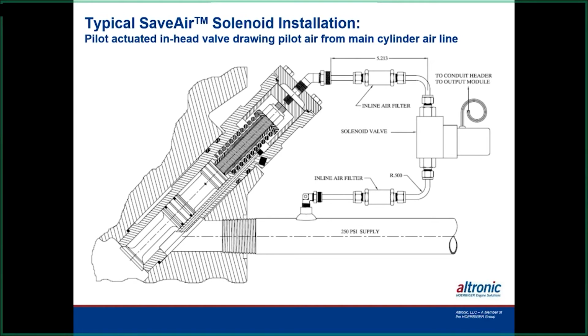To put this system on, we ask that the customer either replace the valves or have them rebuilt in a way that there's more than just cleaning them up, because we need a fairly tight clearance in there to try to eliminate that leakage underneath the piston. Our instructions also cover the filters in there, which basically catch any bad stuff coming back into it, and any dirty gas or dirty air coming in. One thing we found is that in some cases the filters do restrict the flow a little bit, so in some cases we wouldn't recommend running them.